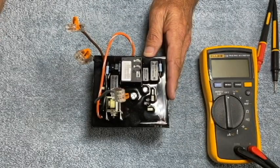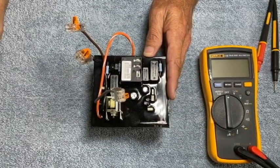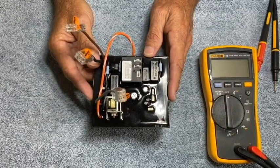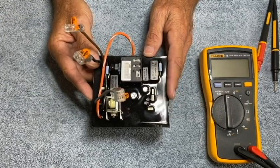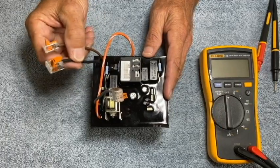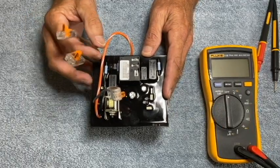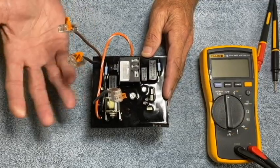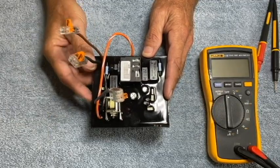How do we test a 230-240 volt 50 hertz motor controller board assembly? We can basically do the same tests here as we can do at the panel or at the EQD, such as the brown-to-black wires for the identifying resistor, or the brown-to-red wire for the on-off switch out-of-water — in this case since it's not installed in a core.